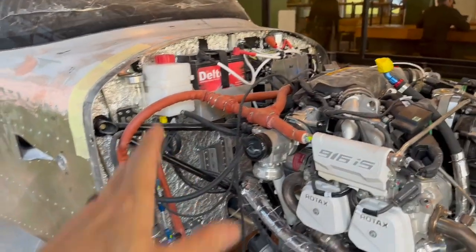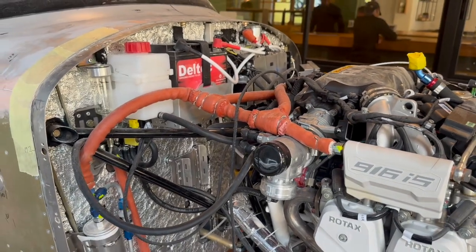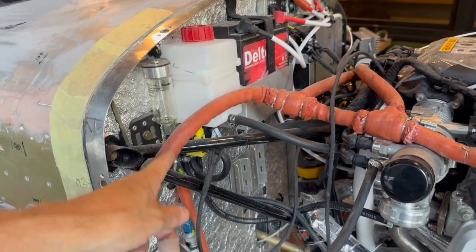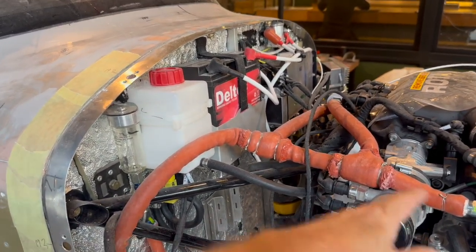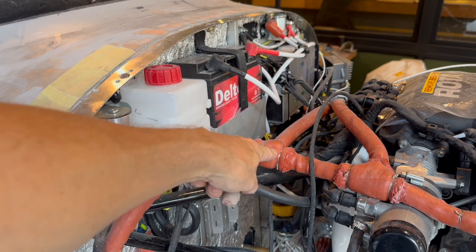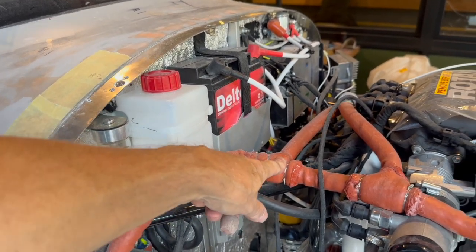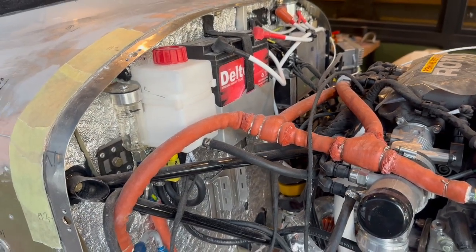We got this kit, the Firewall Forward kit. Turns out that the fuel hose was subject to a service bulletin which came out in July. The annoying thing is that this is all made out of rubber, because I made it out of rubber simply because that's what we had, but it's all got to go in the trash. So what I'm going to do now is come up with a system to make this out of Teflon. I have to change this. This is the jetted T-piece that fits in here, so that's going to have to be something different. I've got to come up with a system for that. I think I've got something sorted in my head. Got to see if it works in practice. It'll be much easier at home on my lathe, but I'll do it here in the cafe instead.